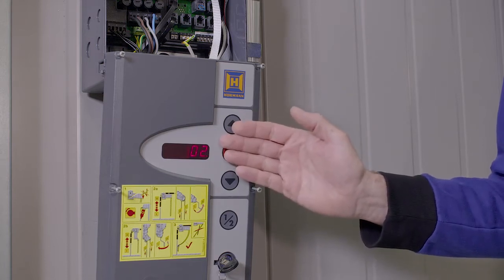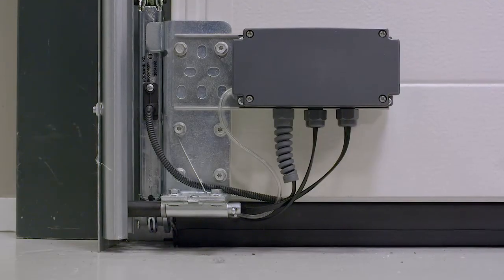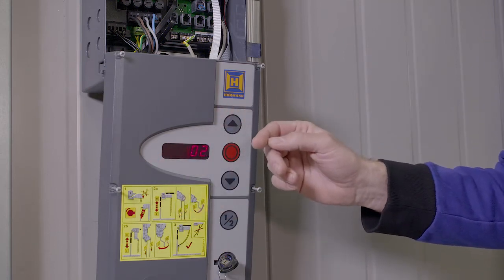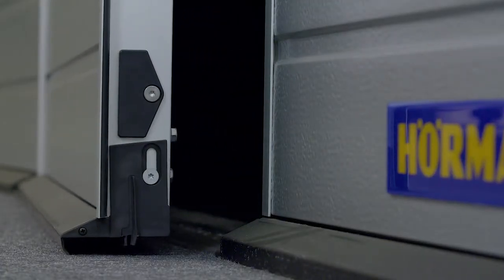Error code 02 is the 24 volt safety circuit that covers the slack rope switches, the chute bolt switch or wicket door contact. Mostly caused by the door being locked, it may also occur if the curly cable has broken, become detached, or wicket door is open.